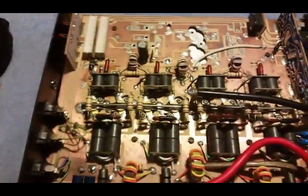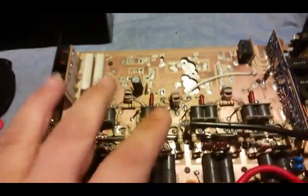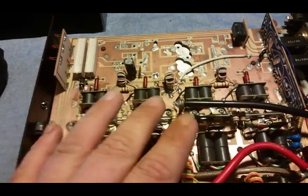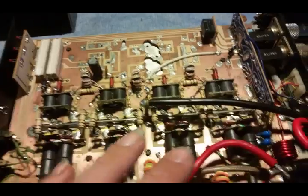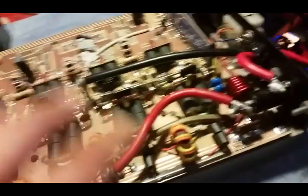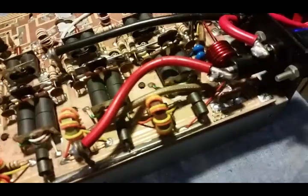I had a couple of things I needed to repair. One major thing I did have to do is completely retune this whole amp — I had to retune the input and the output. As you can see, the output here is broke up. One thing I don't agree with, just personal preference, is the builder always leaves a tuner in on the output, but that tuner is usually only rated at about 300.